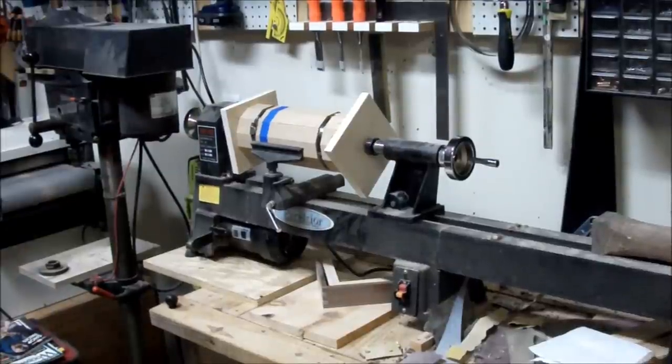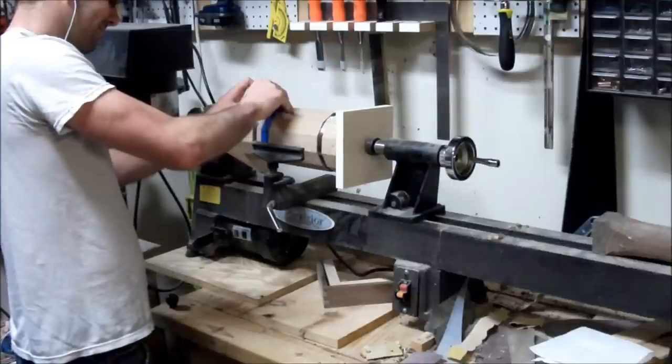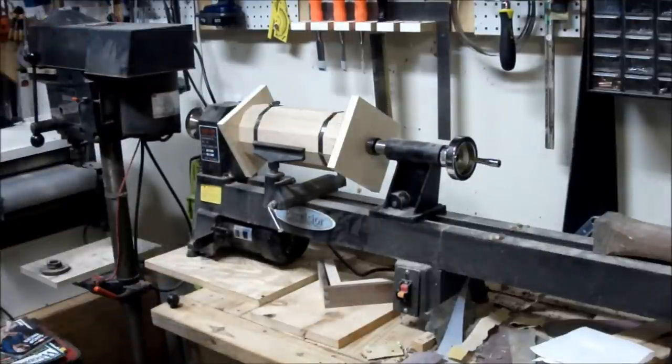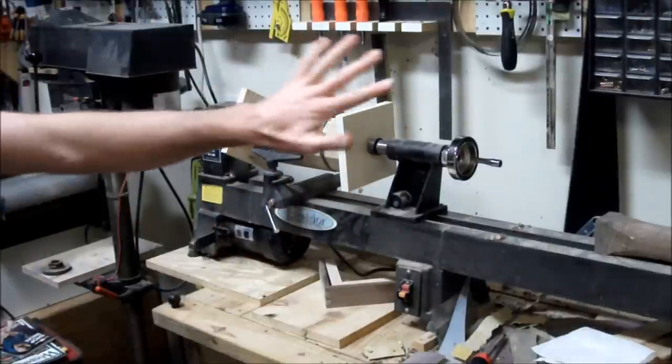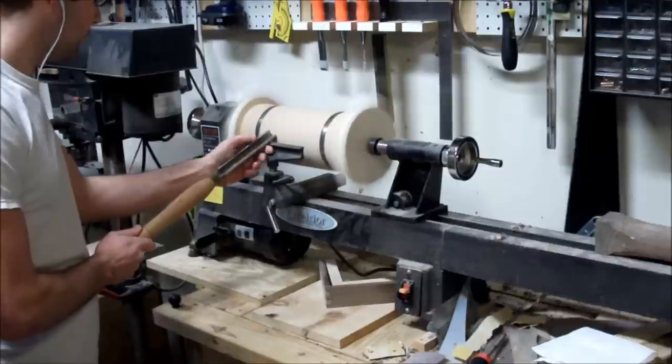To get the cask to be round, I put it in the lathe to rough the outer surface to shape. Looking back on my process, I would rather do this step very last, if I do it at all. The only thing important to be round here is the groove for the band clamps. Doing this step last will avoid the misalignment between the staves and the final product, as you'll see at the end of the video.